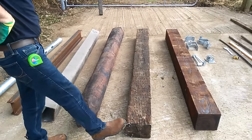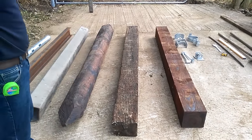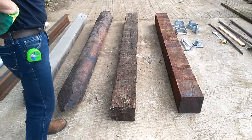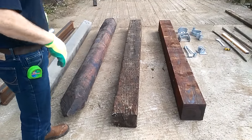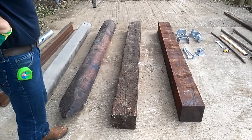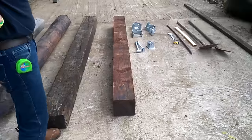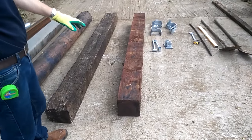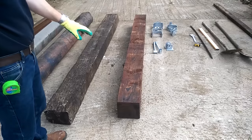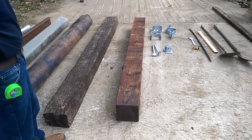Going back to the old sleeper — there's still a lot of people using the old sleeper. Sometimes they'll point them and drive them, but they can twist and you might have to go to plan B again and dig a hole and set them in concrete. Then you have an 8x8, 8-foot-long PDM square gate post, which is normally used to hang a timber gate — more fancy gates than your traditional farm gate.